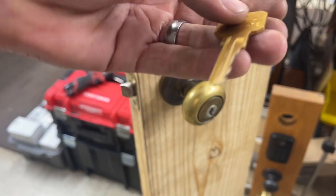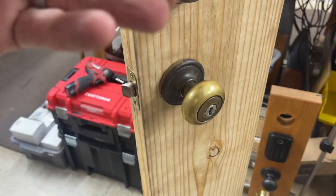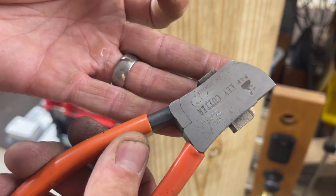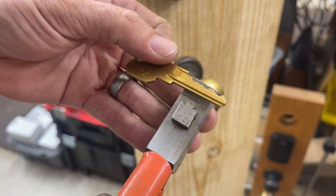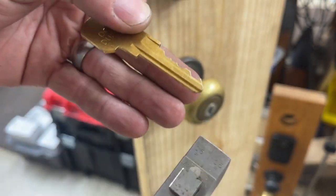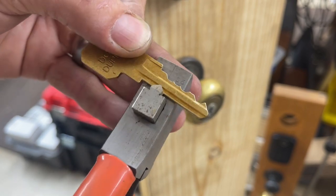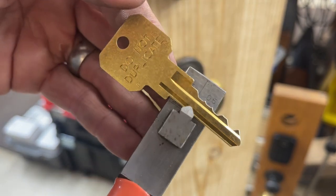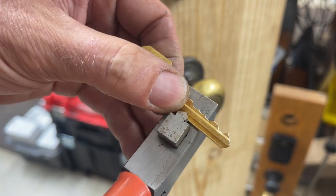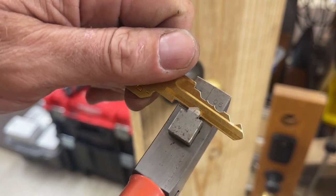We can take one of the keys, because we're rekeying it anyway. This is one main reason why I recommend having a clipper here. Remember, on the card, it tells us to go between 2 and 3, so that would be kind of in this range, and you want to cut right to the bottom of that groove right there. So 2 and 3, we're going to move this over just a little bit